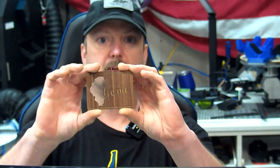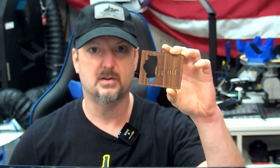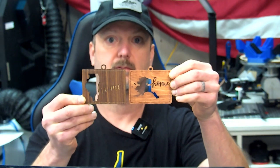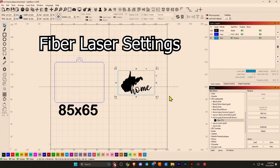Here's our Illinois home plaque fresh off of the CO2 laser — it looks good. This is walnut, so the color's a little different. I could have got that home darker, but I just wanted to run it fast and get it done. Let's compare it with Tyler's original — looks pretty good. So now all we have to do is take this graphic and frame it on the fiber laser, make sure we're lined up, and then adjust our settings.